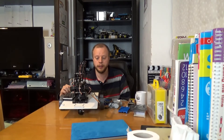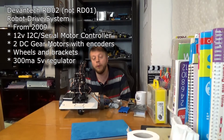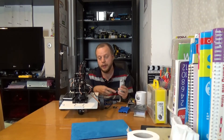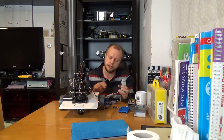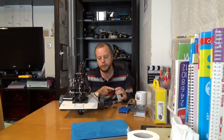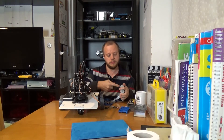The actual chassis is a material that just turned up. I was starting to put together the RD01 kit and went for a walk on the hills thinking about what I could use for a chassis. I stumbled upon a piece of flat board — kind of a dense foam board, very machinable, ever so slightly wobbly — just there in the snow. So I took it home, sanded off the sharp corners, drilled holes for the motors, and it was the ideal chassis, literally right in front of me on a walk up the hill.